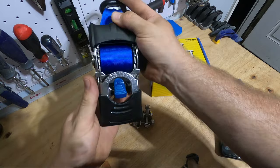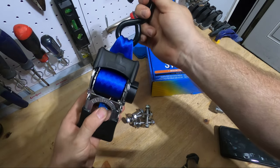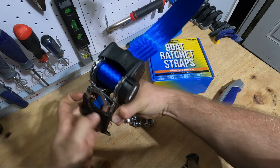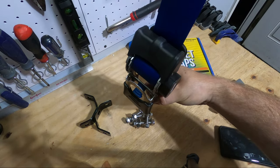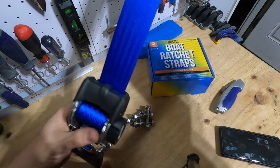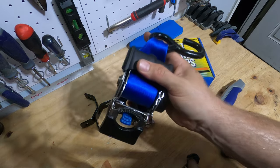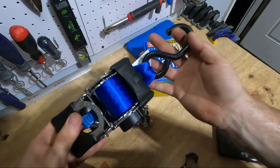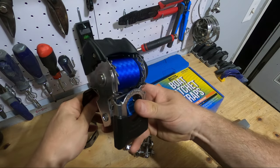So, retractable transom straps — the way they work: this mounts onto your trailer and always stays on it so you never have to take it off. When you're ready to tie down your transom, you push a release, this lets it come out, you hook it onto your transom, and then you crank it down into the ratcheting mechanism. When you're ready to launch the boat, you just release the tie, this comes off, and it pulls right back on — everything is self-contained right on your trailer. It is a quality-of-life, super convenient way of handling your transom strap. It looks like you can also use the angled bracket to offset it off the trailer if needed.